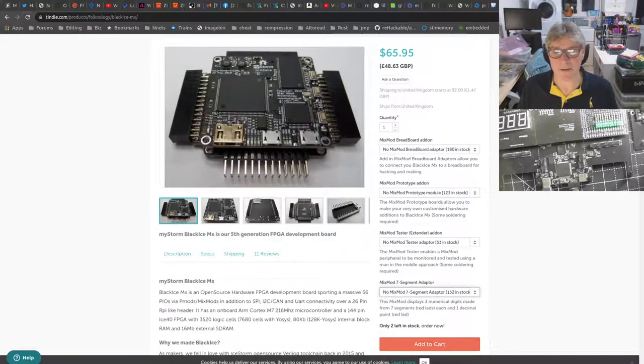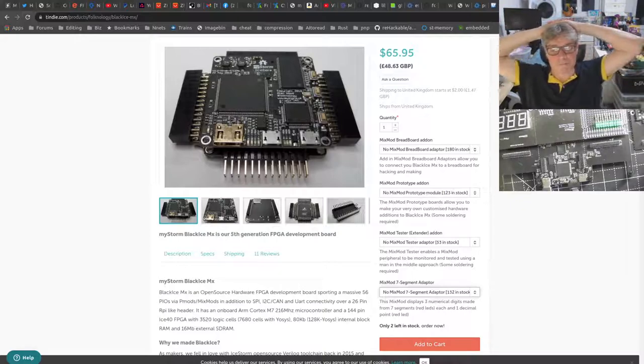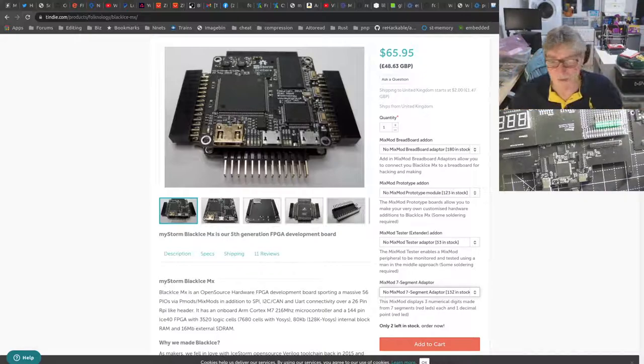And that wouldn't be available on here. So there'd be a separate page where you'd buy the ICE logic board itself, and then you have a choice, then you have a mezzanine choice, maybe. Although the default would be the Hyperflash one. And then you have any number of different tiles that you can select to add in. Whereas this is pre-configured with the 7 segment VGA and the traditional address data bus memory. And then maybe some options, and PMOD options selected by default, but you could always opt out of the PMOD part if you wanted, or opt out of the top part, but then you'd lose the memory, so you'd either not need any memory or maybe have a way of choosing Hyperbus instead. All those options are possible.